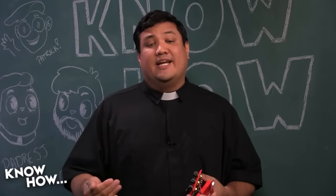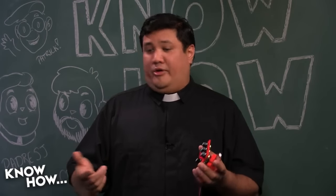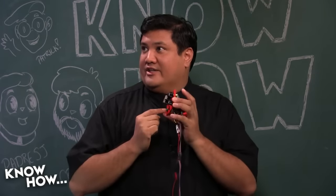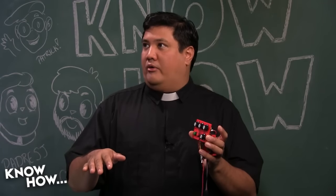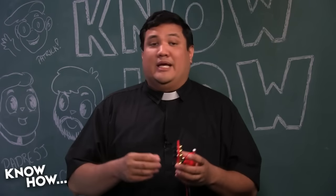But we're going to put in a disconnect circuit to make it really easy for you to switch between on mode and program mode. In other words, this green button, which is an on-off, it's not momentary. In fact, you can kind of hear it clicking. What we'll do is set it so that when you're programming, just make sure it's off, and it completely disconnects the Arduino from power, saving you from any potential hazards of it bursting into flames